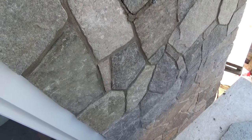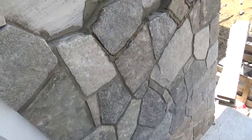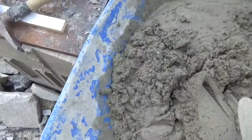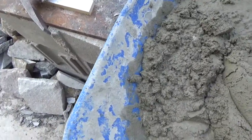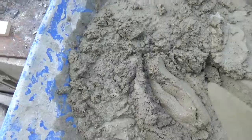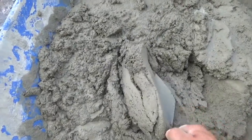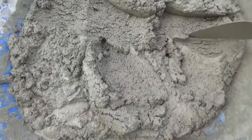And so it's just a waste. It's just quick and easy and efficient to mix up a little bit like that in the wheelbarrow. I mix it up pretty stiff — this is actually looser than I usually do. But if you are a first-timer or not really familiar with the process, you want to probably mix it up and keep it in two batches. Mix it up stiff, and keep your stiff stuff in the back of the mud pan.